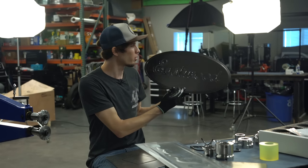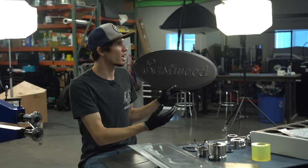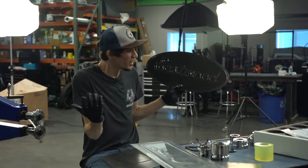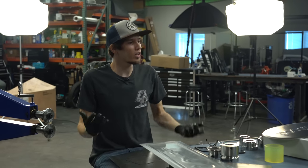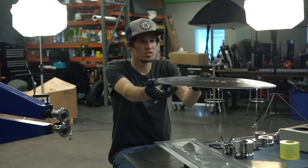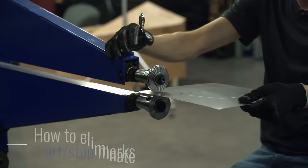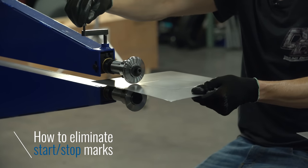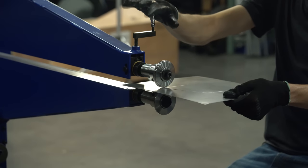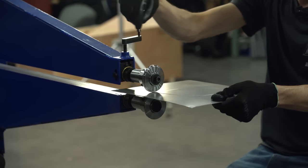I did four or five — I think five total passes on this — with different depths and different die setups. The boss man at the auto body shop might be pissed if you do that many. It all depends on the project you're doing, but if you want that warp out, this is almost perfectly flat. If somebody said something about starts and stops, if you want to get rid of those start and stop points, keep one hand on this and just bring it down until you feel a little resistance.